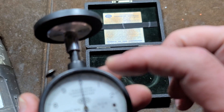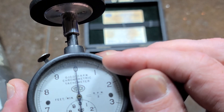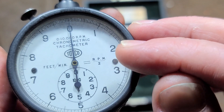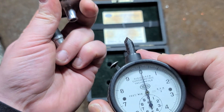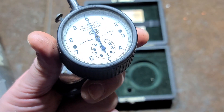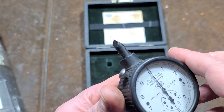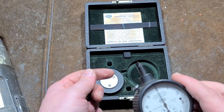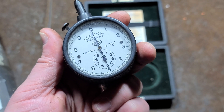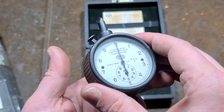What the surface wheel tells you is feet per minute — it's RPM divided by two. So if you use this surface wheel and it read 1,000, you'd divide by two and know the surface was traveling at 500 feet per minute. Since this is a 10,000 RPM unit, it can measure a maximum of 5,000 feet per minute, which is almost 60 miles per hour — about 57 miles per hour.